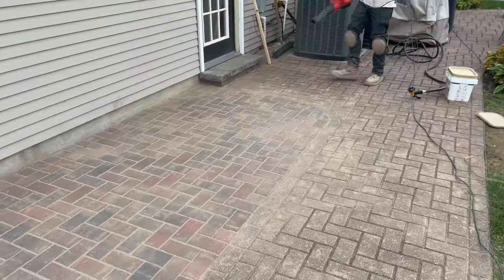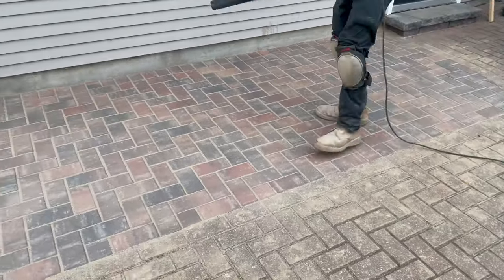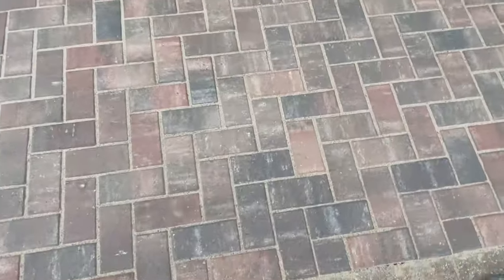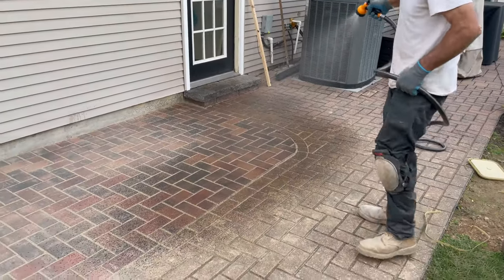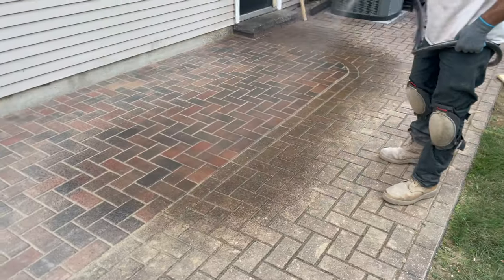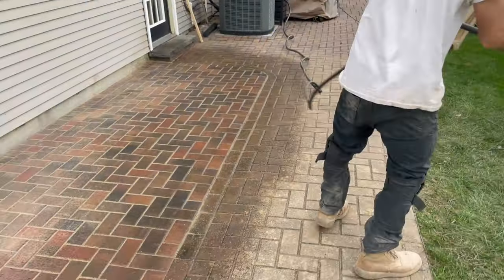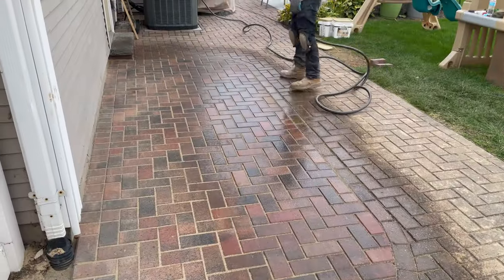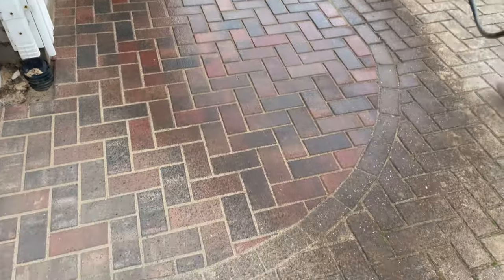Then blow off excess sand with your blower and finally you mist water over the top of the patio. Don't use anything but a mister or you'll wash sand out of the joints and you can also water down the glue, which can cause the polymeric sand to become kind of brittle and can actually even grow mold. So just a real light misting. If you do this step correctly, the joints will become really hard and that'll help prevent weeds and bugs.